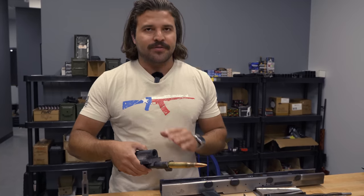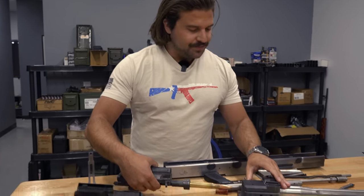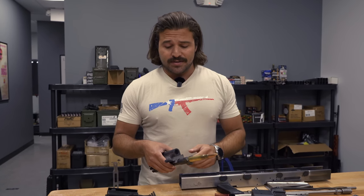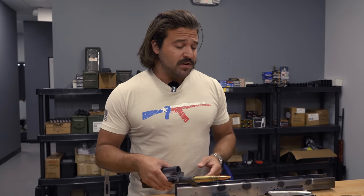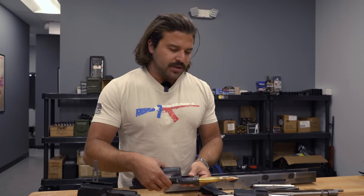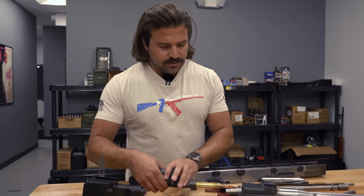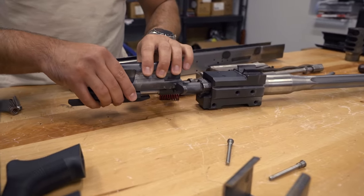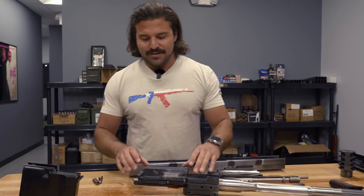So we have our completed bolt. There's no firing pin in it, so we're not at risk of exploding here, though theoretically it would be fine — this actually could fire as is if I had a firing pin. After we got this back from heat treat, the bolt is hard and the front trunnion's hard. If this bump pin didn't work, it would literally just stop out of battery and not allow it to rotate. But let's go ahead and try this — fit it in the trunnion.